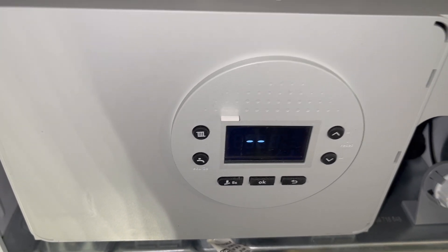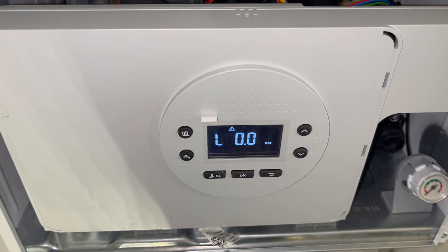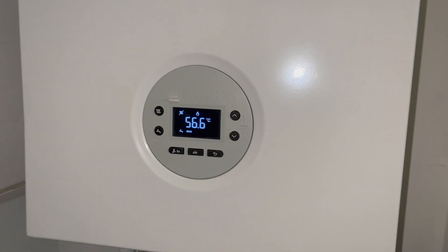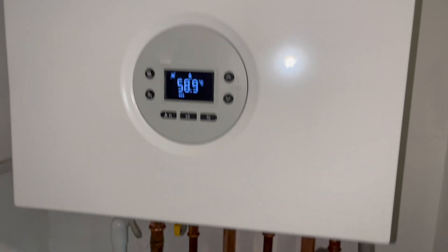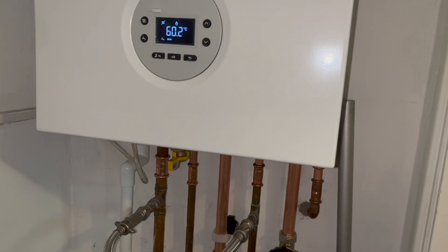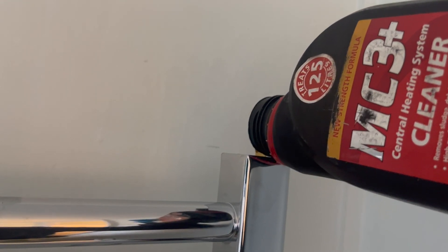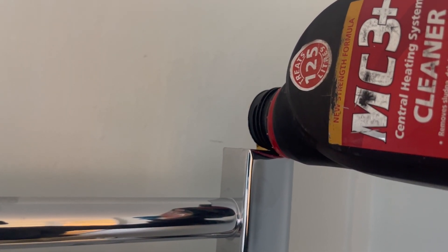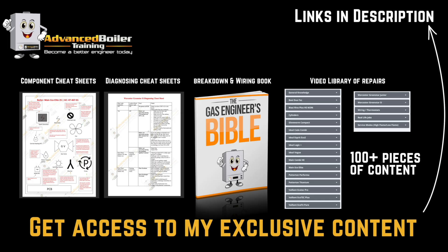At this point the boiler is pretty much all done. I just need to fill it up, set up the boiler, set up the thermostat, and do all the small finishing things like tidying away the cables and making everything look neat. While I'm doing all of that, I'm going to run a hot flush with the heating on. Once the hot flush is done, I'll drain the system, isolate the towel radiator in the bathroom, then fill it up with inhibitor, bleed it, and make sure everything's working correctly.